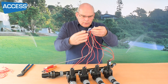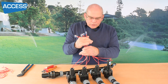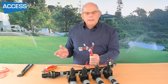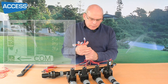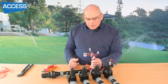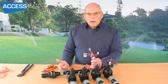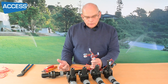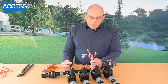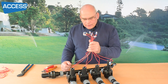They're all nice and tight — I can see everything is connected and I have no loose wires. Before tidying up, always go back to the controller and check that they work correctly. At the panel, red goes to number one, yellow to number two, green to number three, blue to number four, and then the black and white wire both go to the common — so you've got two wires going onto the common.